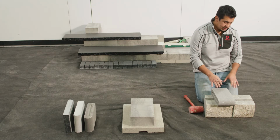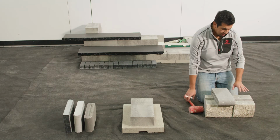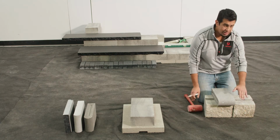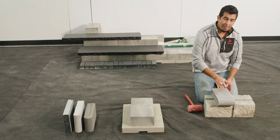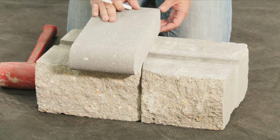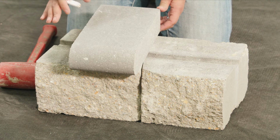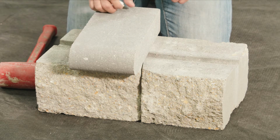Traditionally, steps have been built out of segmental wall, where we basically mallet set each individual wall unit, leveling front to back, side to side, and then provide a coping piece on top as your stair tread. One of the drawbacks with that technique is always the reliance on that base not to move, and for these individual units not to flex or move independently.